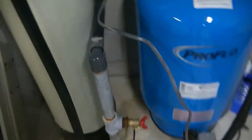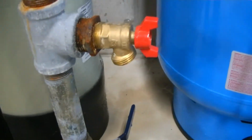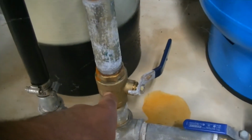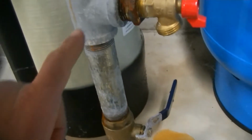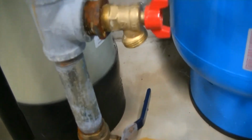We're back where we started, here in the basement. Like I said, here is our drain for the sprinkler system. We're just going to open this up. And I like to keep it open. Like I said, for some reason, should this valve let any water up, it's going to stop here and trickle out, and I'll see it leaking. But this is just the way I do it.